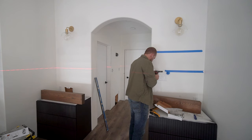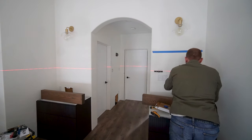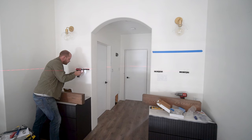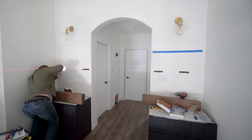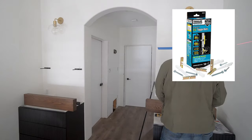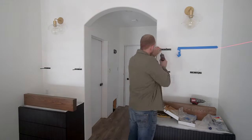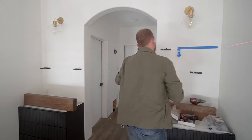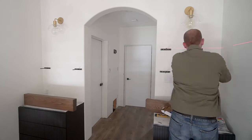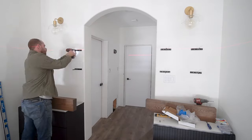The bracket kits do come with plastic wall plugs, but I would recommend not using these and instead try to tie into some timber structure within your wall if possible. I find plastic wall plugs don't work really well, and since I want to use these shelves to hold books and decor, I wanted them to be secure. If you do need to use a wall plug, I'd suggest a specific toggle-style type as they have the best hold. If you're using softwood, particle board, or MDF, consider adding more brackets or reducing the spacing, as the material isn't as strong. If you're planning to put heavy things on the shelf, you may also want to add extra brackets.